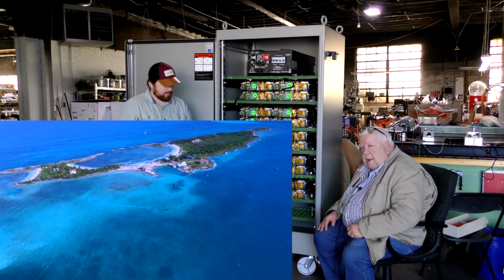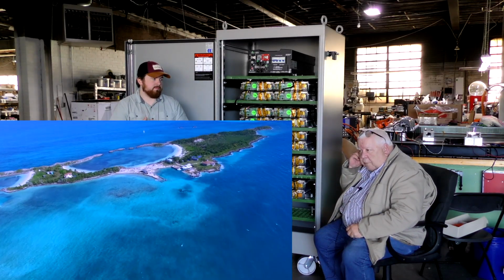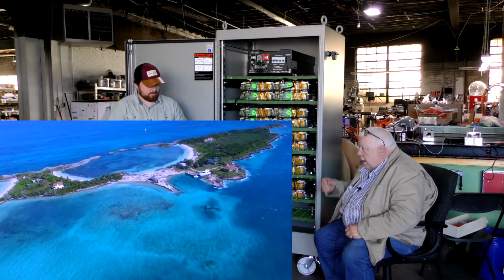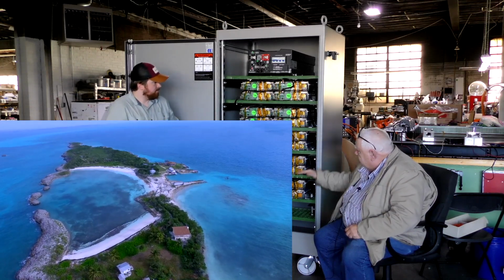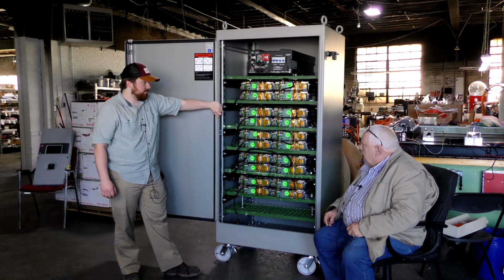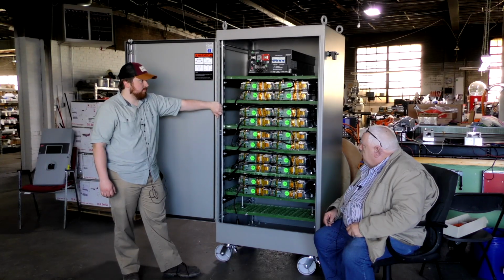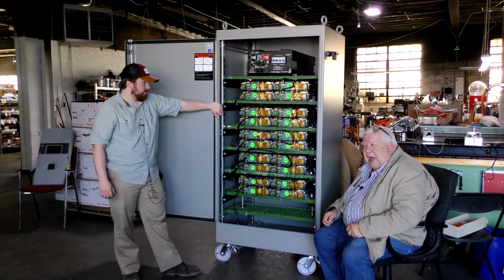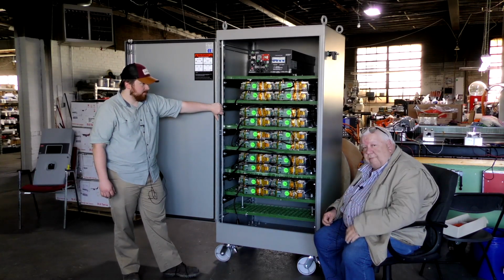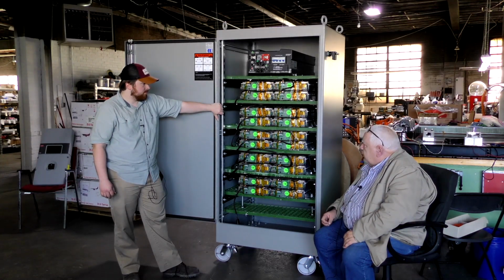We have 20 Tesla Model S modules in a 2S 10P, 10 in parallel, two in series, and 10 sets of those in parallel, for 48 volts. They're nominally 5.5 kilowatt hours each, so that'd be about 110 kilowatt hours. We don't fill them up all the way, maybe 4.1 volts. And so we call this the PowerSafe 100.